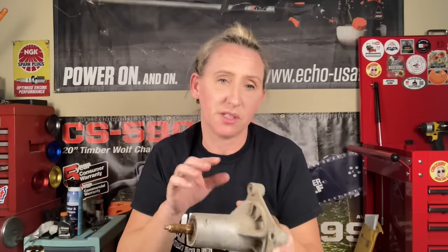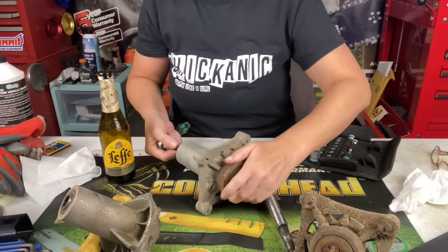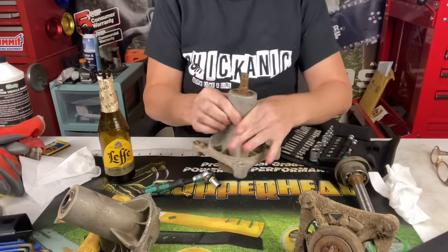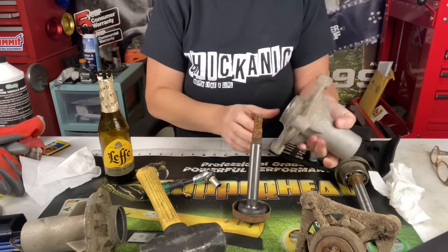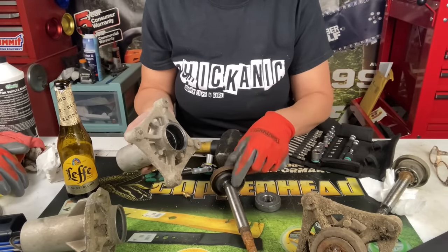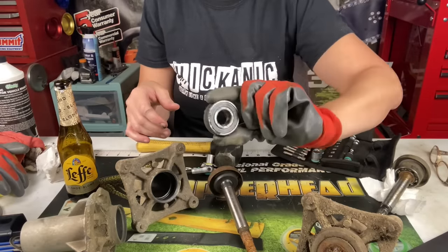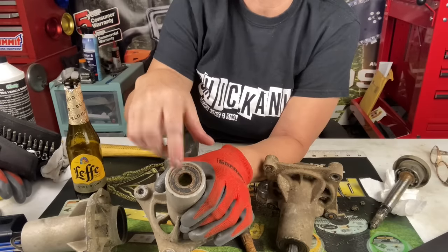I'm going to take this one apart — this is one of the older ones — to show you exactly what's inside. First, since I'm going to be beating it out, I'm going to go ahead and remove this Zerk out of it, like I did with the last one. Here's what we got in this thing. The bottom bearing did not come out when I took the shaft out, which usually it does — usually it's stuck like Chuck and very hard to get off. I did have to beat it out. These are sealed, completely sealed bearings, both sides. They've always been like that. On the top bearing, it's always been a flat surface, and you would have to apply a spacer before you put your pulley on.